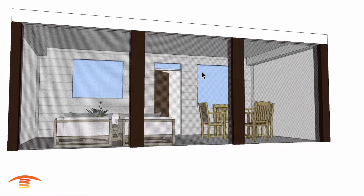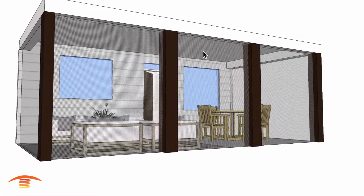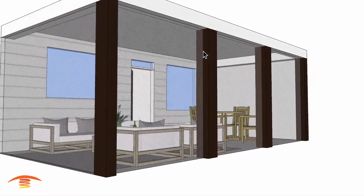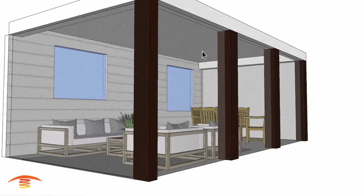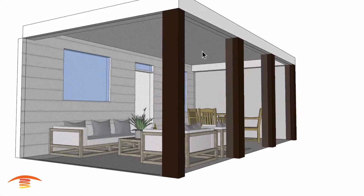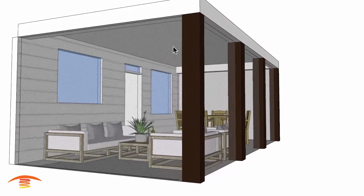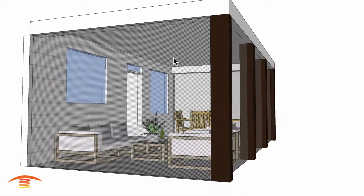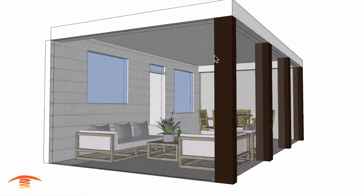Now, a couple of things they did mention was the fact that this is a vinyl ceiling, so I'm not sure how to address that vinyl ceiling issue. I can say though that if it's structurally strong enough and you do meet the clearances to combustibles, there should not be an issue with that. Now, that being said, I don't know what the true maximum temperature increase a vinyl roof could handle would be. However, you might want to check with your supplier for that vinyl ceiling, and that would possibly help determine that information.